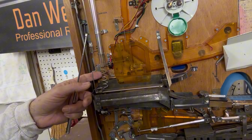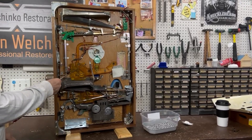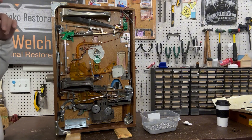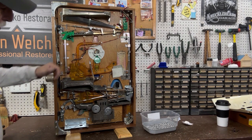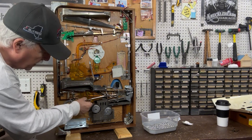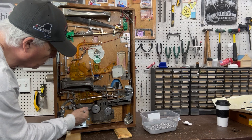So what you want to do is make sure that the seesaw is sitting with the right end up, not right end down. This plastic here will catch any ball that comes in as a win, let it run down this ramp, run into the seesaw, and the seesaw tips. It lets the ball come out down this vertical shaft onto the tip of the jackpot arm. The jackpot arm is right here — not this one, it's this one inside. The weight of the ball pushes the jackpot down, and when it goes down the jackpot mechanism will tip and let the 14 balls out. Then the whole system will reset itself.